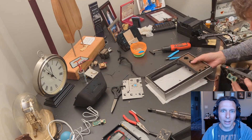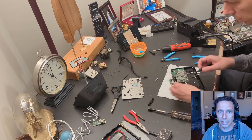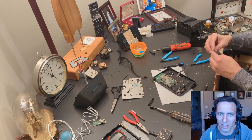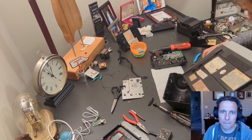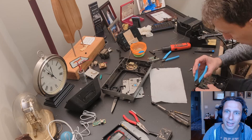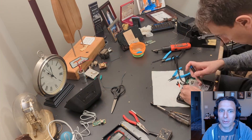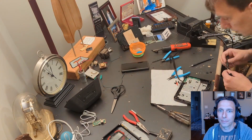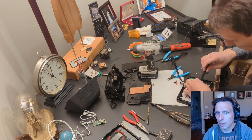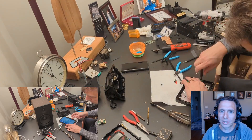The speaker wires coming out there are pretty good — thick enough, they did what I needed them to do. The CPU is covered in blue thermal interface material. I was a little surprised to see that, but I felt how hot it got, so I needed to get a heat sink for that, because it used to connect to a giant sheet of copper tape on the back of the speaker enclosure. I got a heat sink I had gotten off Amazon for an SSD.